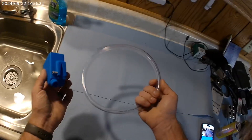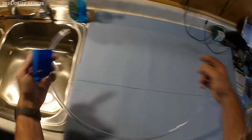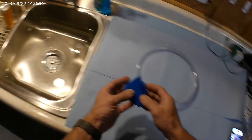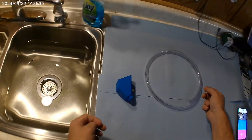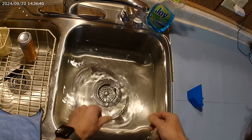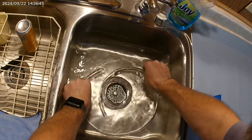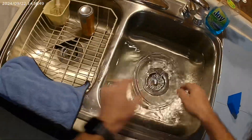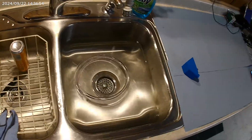When you receive your product you're going to get three feet of hose coiled up in your package. Once you get it and you're ready to install it on your press, go ahead and drop your hose in hot water. This is so we can let it soften up and be able to mold it to whatever we need.